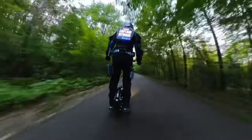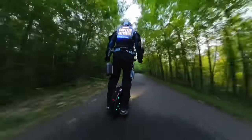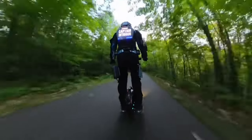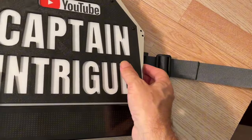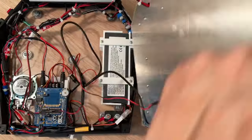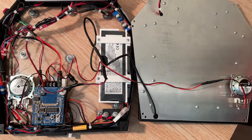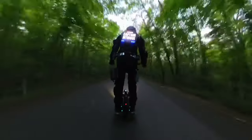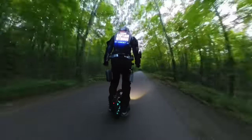This will be especially beneficial for me since the exciters will be mounted in my backpack, and yet the sound will appear to come from all around me, making it much more intriguing. I attached two exciters to the outer and inner shell of my backpack since those were the two biggest surfaces I had to work with. The exciters are actually so loud and powerful that I had to turn the amplifier way down, or it felt like they would tear the backpack apart from the vibrations.